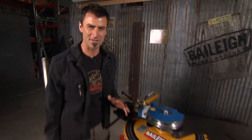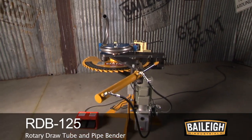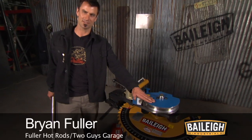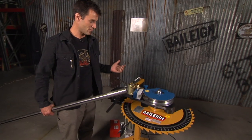You're ready to graduate to the powered bender — you're ready for the RDB 125. This is my own personal machine, so I can give you a mini tour pretty easily. This will go up to about two and a half inch mild steel. We're gonna do one and three quarter right now — this is DOM. It'll go up to about two inch schedule 40 pipe, so this thing's got a lot of beef.